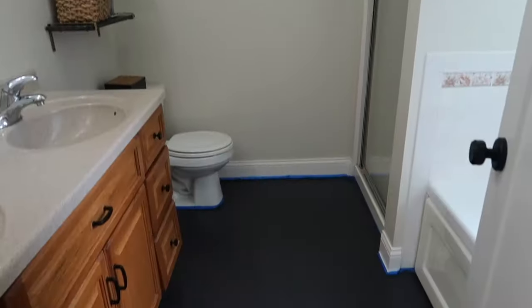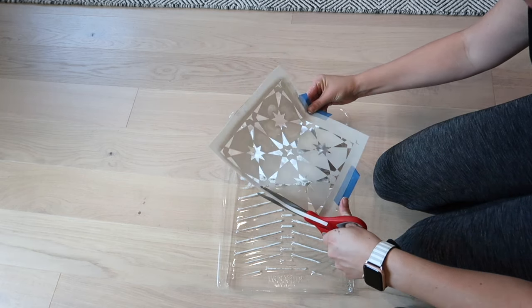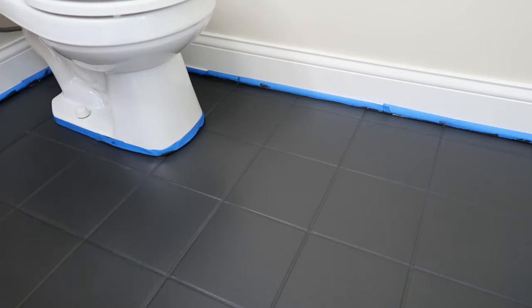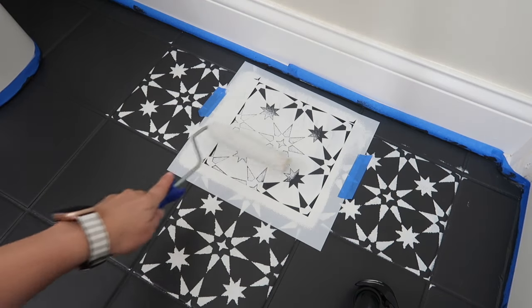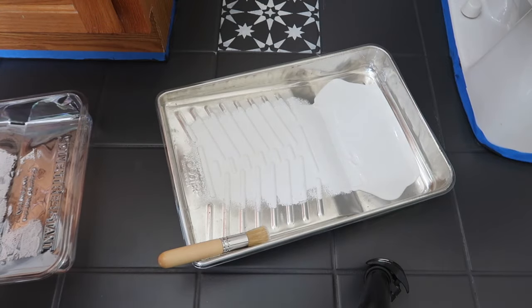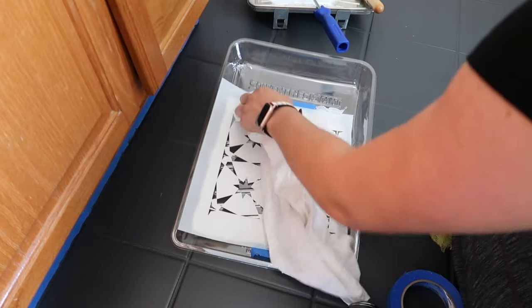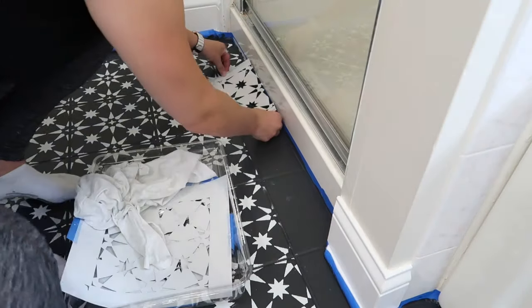It's day two of my painting project. The base coat in that charcoal gray color is all dry, and now I'm ready to stencil. I went with this stencil and bought a few of them — it's nice to have extras so you can cut them for tiles on the sides or around the toilet area. Before I get started stenciling, I use a tack cloth to wipe the floor to make sure all of the dust is gone. I use painter's tape to keep my stencil in place while I roll with a 3/8 inch nap roller. The key is to use a very small amount of paint — get the roller in the paint and then load off as much as possible before transferring to the floor. Also keep an extra paint tray or piece of cardboard handy; you can rest your stencil on there as you move around and be sure to wipe off the back. I do all of my full tiles first before working on the edges of the room. For the smaller tiles, I cut the stencil to size and use a stencil brush for the tight corners.